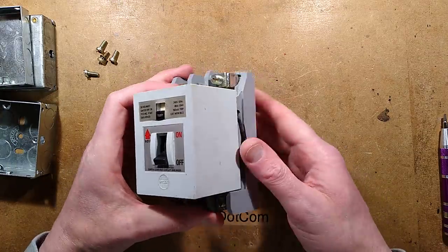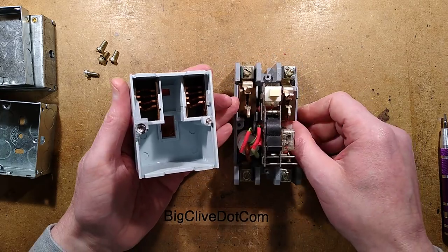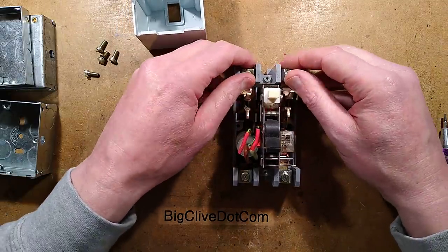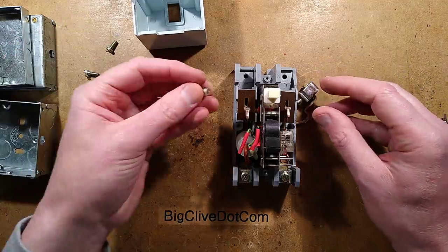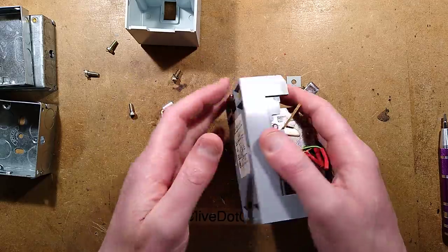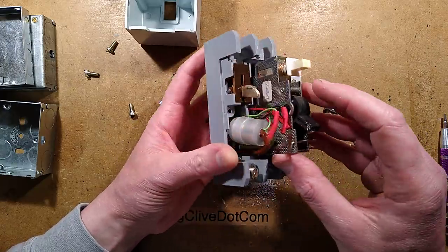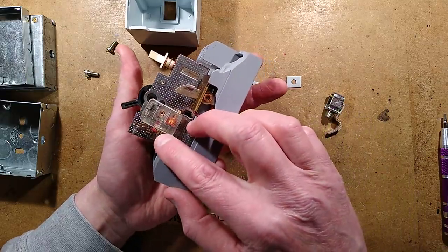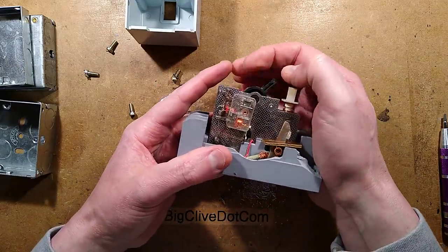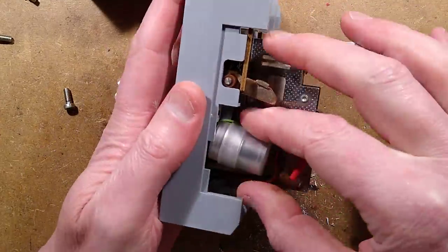We're back — this was already making loud springy metallic noises and I had a horrible feeling it was about to disintegrate, but it didn't. Look at the big arc breakers — that's quite neat with fairly decent-looking contacts. It turns out I didn't need to unscrew these, but I did. The reason the screws were covered in waxy stuff is that underneath the hot-melt they're part of the contacts — they're live — so that was insulation as well as covering. This here is the trip mechanism. Let's zoom down on this — this looks like the sense coil.